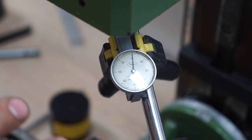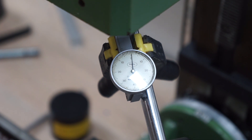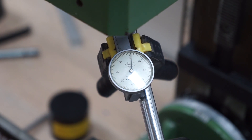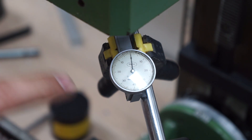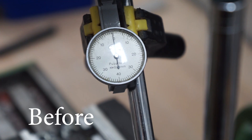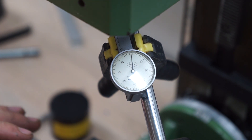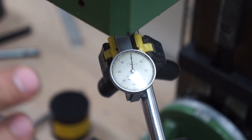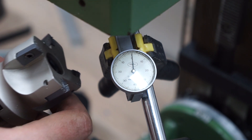I think it's settled on a good amount now. So I'm going to turn this mill on and you can see the run-out — that's about 1.5 hundredths of a millimeter, which is the exact same number as it was before. But that already is good — it means I didn't screw anything up with the shaft or the spindle, and the bearings are well aligned. Where this should shine is heavy loads, like from a face mill. So I'm going to set up this big cutter here and take a pass.